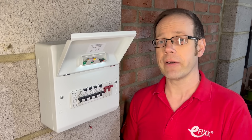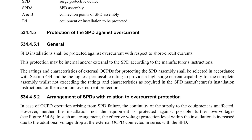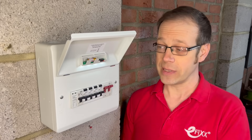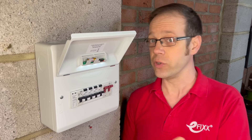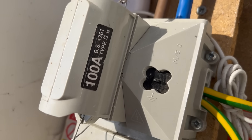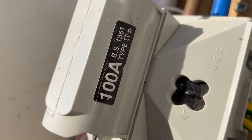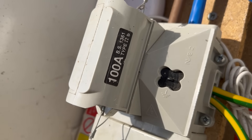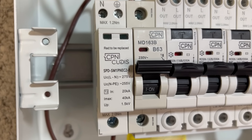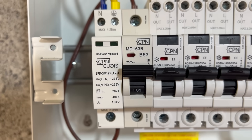There's also short circuit protection, and it needs protecting against even for an SPD circuit by means of an overcurrent protective device. BS 7671 specifically requires this in regulation 534.4.5.1: SPD installations shall be protected against overcurrent with respect to short circuit currents. This protection may be internal and/or external to the SPD according to the manufacturer's instructions. So it is required, and it is possible to have it built into the SPD, which might be why some brands don't require an MCB. However, some manufacturers prefer not to rely on this and recommend the use of a dedicated overcurrent protective device to create an additional layer of protection in the rare case that the SPD reaches an end of life event and becomes defective, creating a short circuit situation.